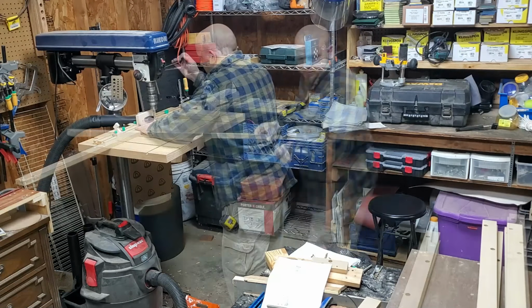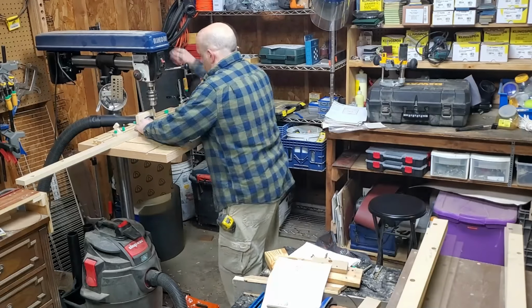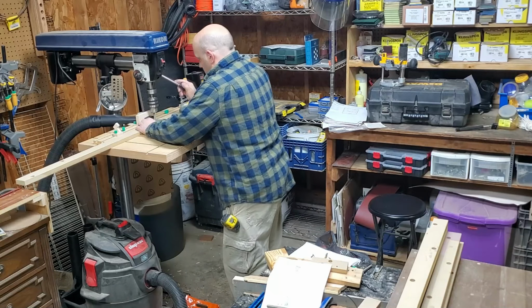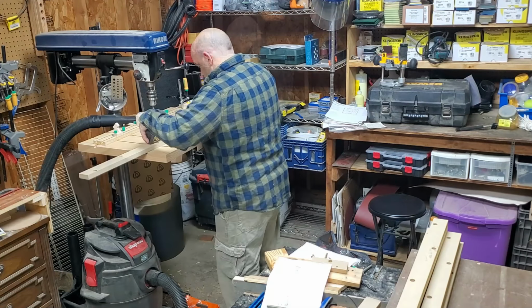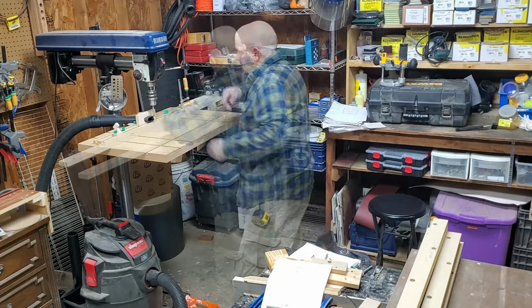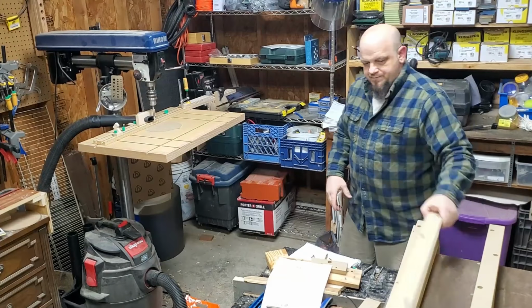So now I went ahead and took some time because I was having some problems with the assembly. The router wouldn't start when I turned the machine on. Turns out it was a simple wire that had come loose in the solid state relay, a 2-minute fix. So in the meantime, while I was thinking and trying to figure out my problem, I thought I'd go ahead and knock out the spoil board manually.